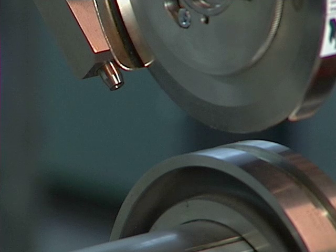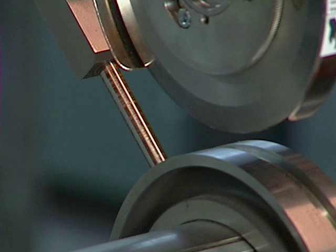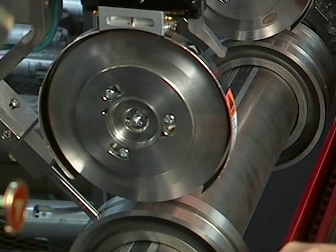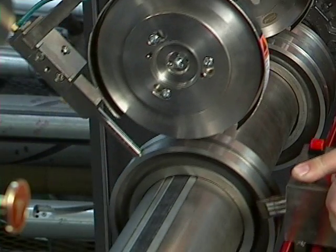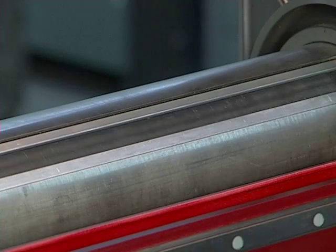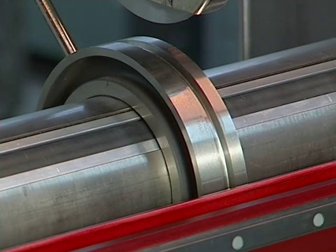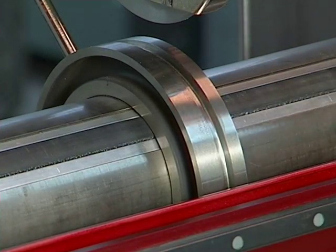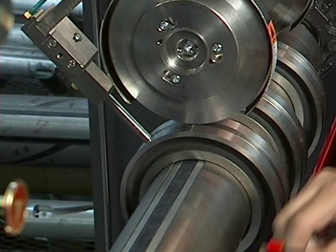You can also reduce setup time with the DMS module together with a linking module. Engage the lower anvil ring to the upper knife holder through the linking module. This allows repositioning of both knives together while preserving the slitting geometry. Since the knife set is moved together and the display is accurate to within .007 inches, you can set up accurate roll width more quickly than if you have to measure manually and reset the knives.